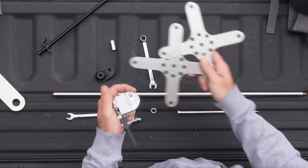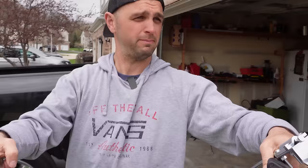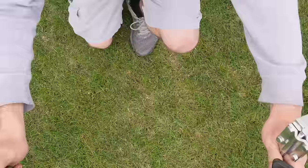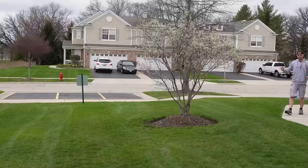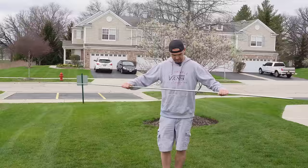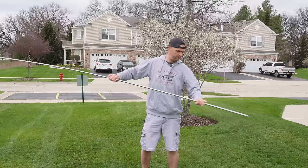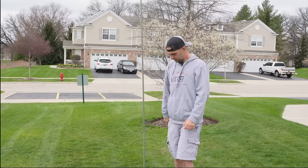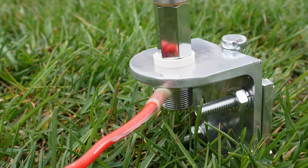That's it right there, and we're going to get really nifty in just a moment and see if we can make a multi-band vertical antenna. With the Wolf River Coil antenna, which is 17 feet, you'd have 20, 15, 17, 12, 10, 11, and 6 meters. It's probably too long at this point for 2 meters, but we can find out later.